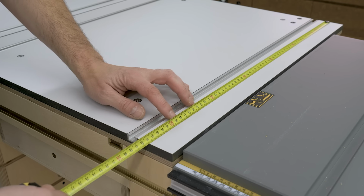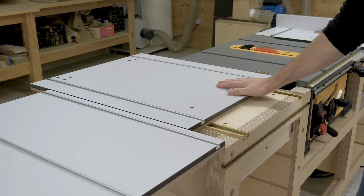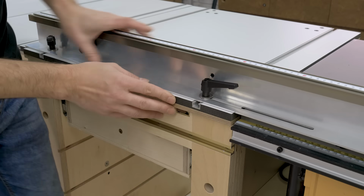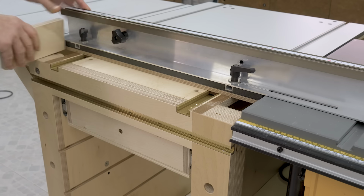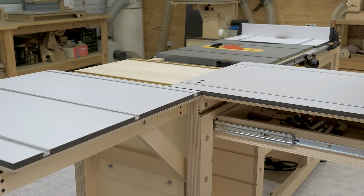I'm going to unlock the sliding carriage to make some cuts. I'll also set up its fence and the support that, along with this drawer, will allow me to use the carriage to cut large work pieces. I've left the sliding carriage and folding table at the same height, but when removing the screws that lock the carriage, it goes up a few tenths of a millimeter, just enough to make it work better.